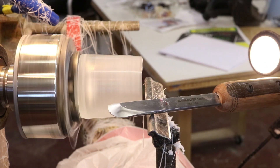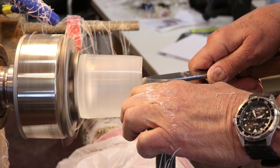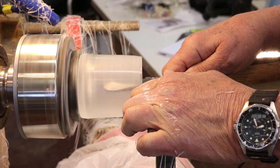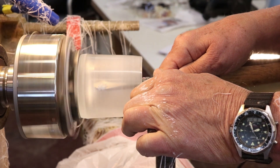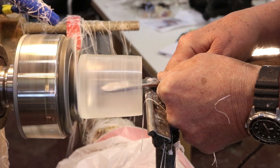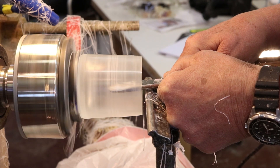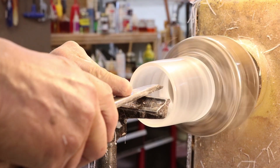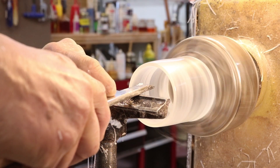In the upcoming few minutes you'll see that this tool really does work quite well. I have a piece of cast resin chucked up into my lathe and I'll run this tool through the paces. Off camera I put the inserts into my tool handle and they work very well — it doesn't take much to flip this tool around. Right now it is in the inside cutting orientation, and in a little bit I'll show you how it cuts on the outside. It's pretty much the same technique. This is a very good tool — I really like it a lot.